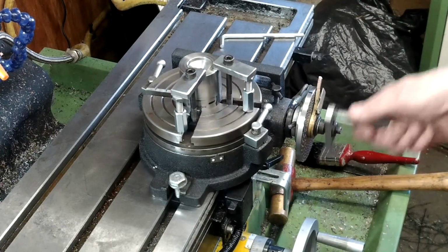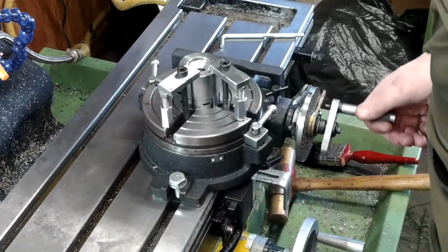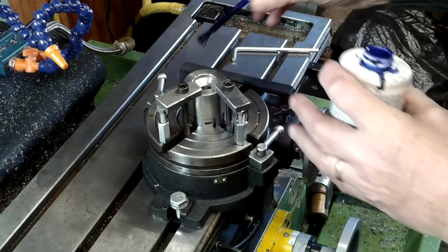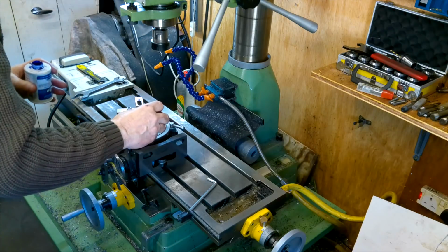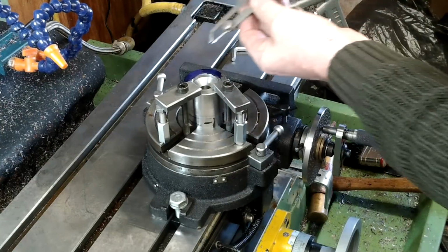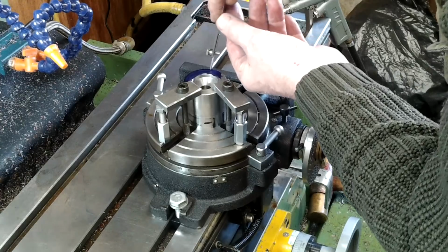Here you can see me whizzing the handle back and forward a few times just to see if anything falls off. The outside diameter of this material is 5mm radially bigger than what I will eventually require, but for now I need to make sure that the drill holes don't go wandering off centre. So here I'm marking a line at 5mm from the outside edge. This enables me to line the centre drill up before I get going.